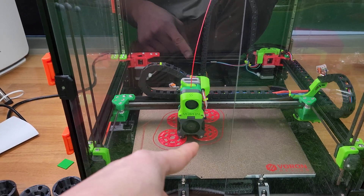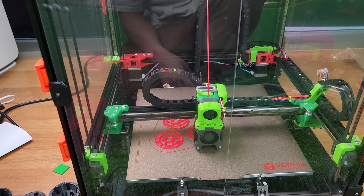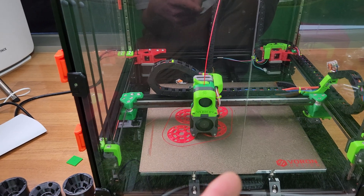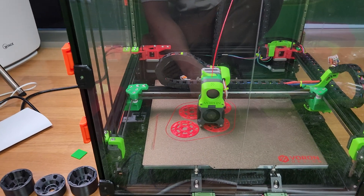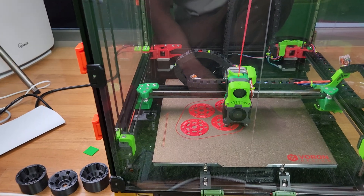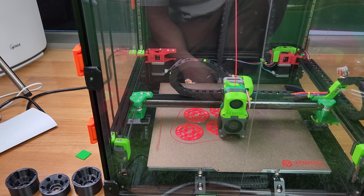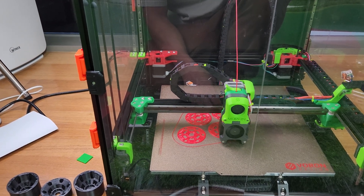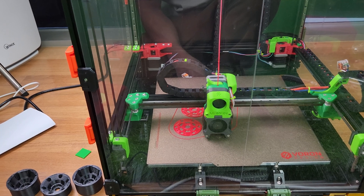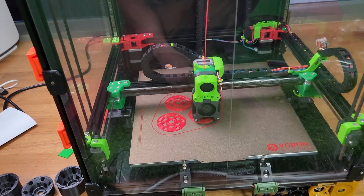The hot end — I've been able to reach with PETG a volumetric rate of around 20, maybe 25. So this is Dragon Standard Flow, and I do highly recommend the High Flow — that's going to be one of your limitations. Or if you want, you can go Rapido — I have the Phaetus Rapido on my Rat Rig which comes as default, and that can push like 40 to 50 volumetric. At those rates, your printer's going to reach its maximum speed.